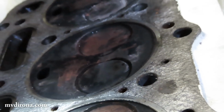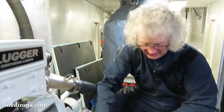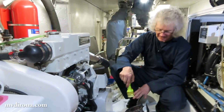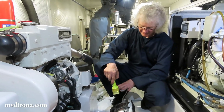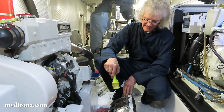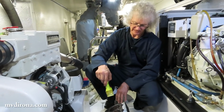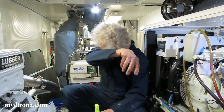However, because the boat's been in some unusual situations, it's possible, in fact it's probable, that has led to water being in there. And I think the lesson there is that water inside an engine is bad, but if you get the water out of there and it's run soon after, they do fine. It's not going to cause them problems at all. So I think whenever there's been extreme rough water, it's probably worth making sure this engine doesn't have any residue left in it, and the engine's been run up to temperature, just to boil anything off and get rid of any problems.